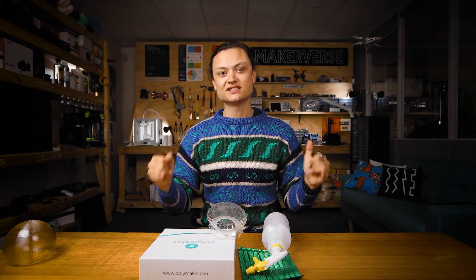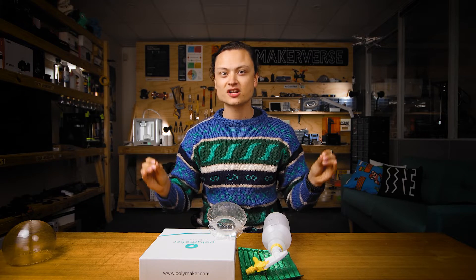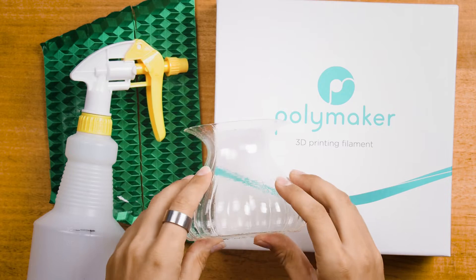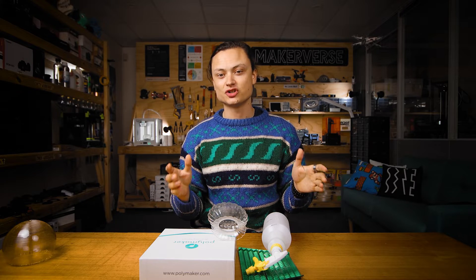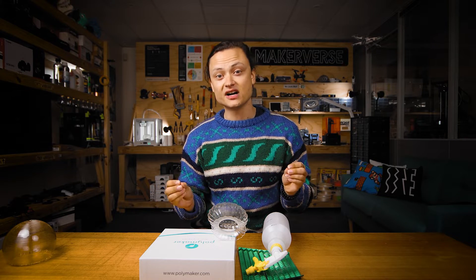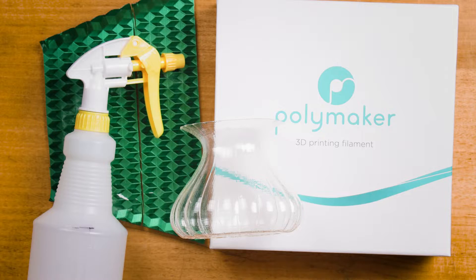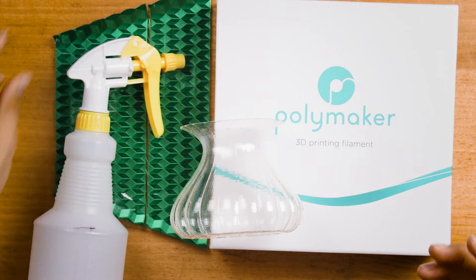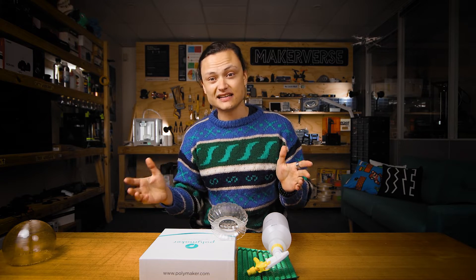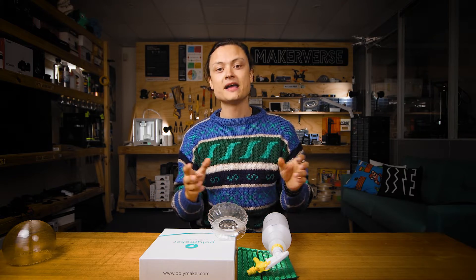On the table before me is exactly what you need to turn a PVB printed component into a see-through glass-esque component. You will need a component made from Polymaker PolySmooth transparent, and for the best results you're going to use a thin-walled object which you can easily get to all the surfaces of — components like a vase or a jug work really well. You'll also want a spray or mist bottle with isopropyl alcohol, and a platform to let those components dry on without many contact points. A 3D printed PLA or ABS infill grid works really well.